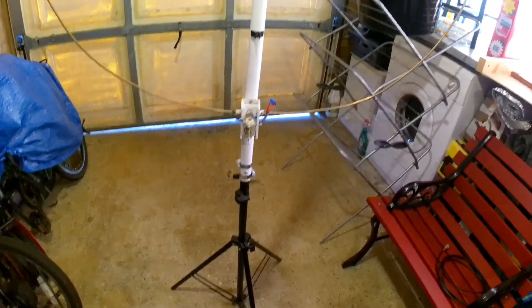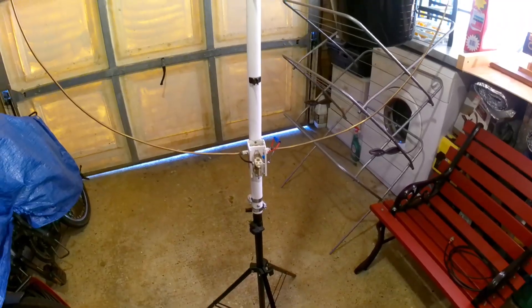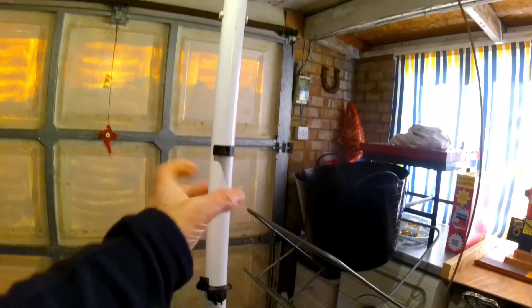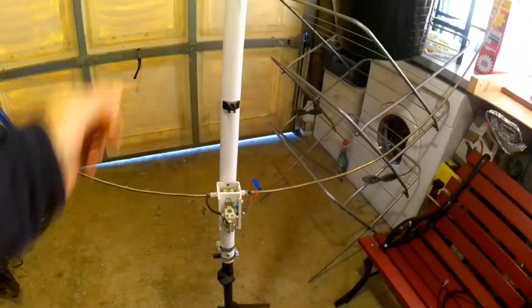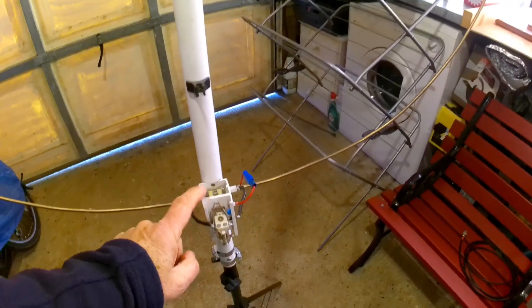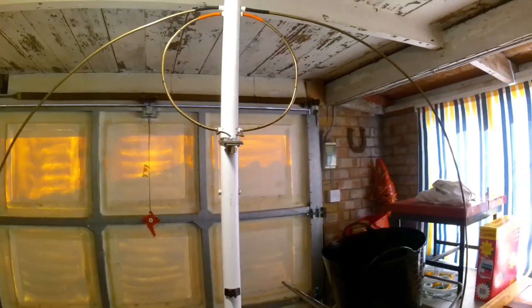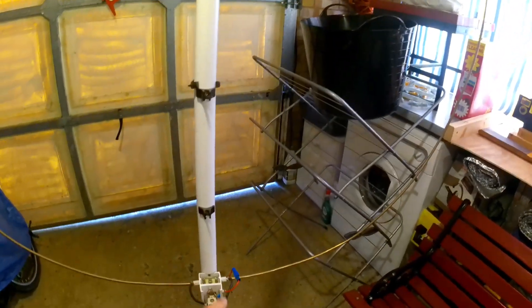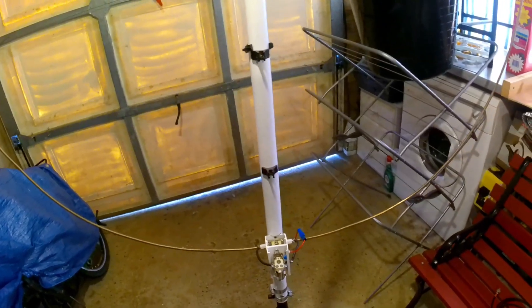The only problem is at the moment it's blowing a hoolie out there, and because there's hardly any weight to it, it's likely going to blow over in the garden. I need to sort out a coax lead that's long enough. I quite like making stuff - this was another one of my projects, leftover bits and pieces from curtain locks and clamps. If I had some better high-voltage capacitors, I could probably run a bit more power through it. It tunes really well, but the high Q means it hasn't got a very good bandwidth - any time you change frequency you have to retune it with these capacitors. I'll get a radio in a minute to demonstrate.